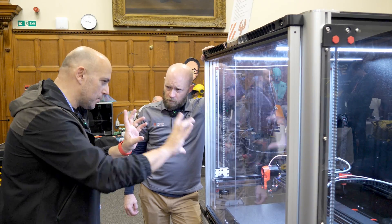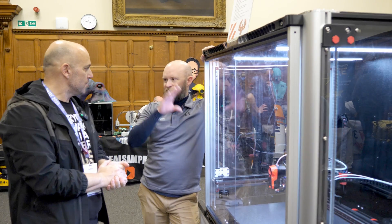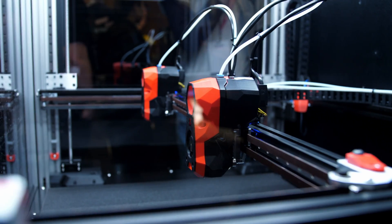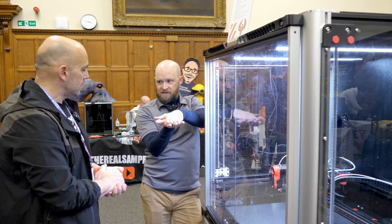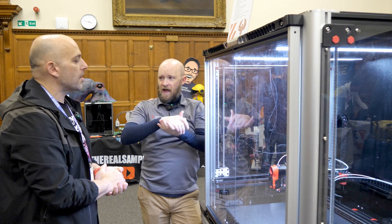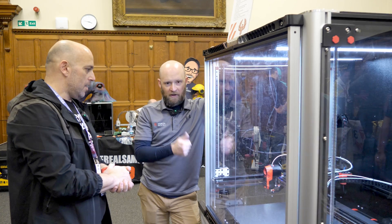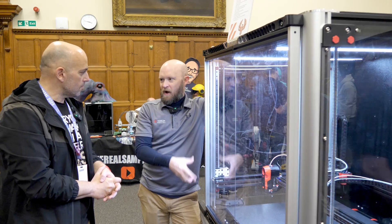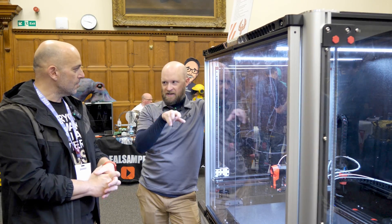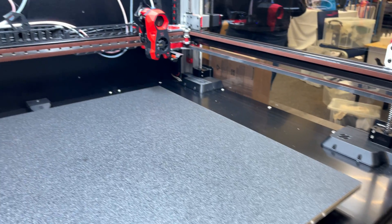The tool heads are using the VoronTap nozzle probe system, where there's an optical beam sensor: when the nozzle hits the bed, the tool head lifts up, interrupting that beam — that's what triggers nozzle probing. It's directly probing the bed with the nozzle, so you don't have to know the offset from any other probe. The nozzle hits the bed and that triggers it.